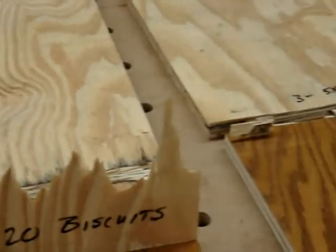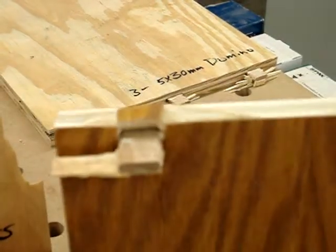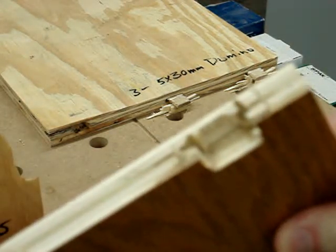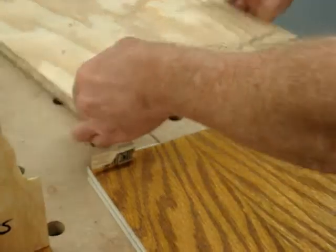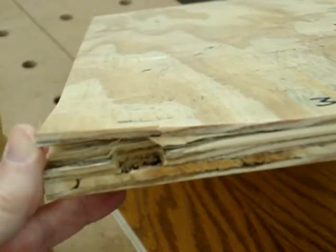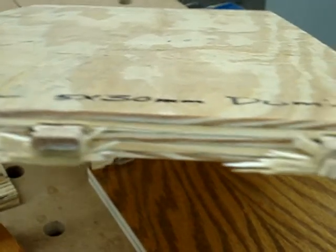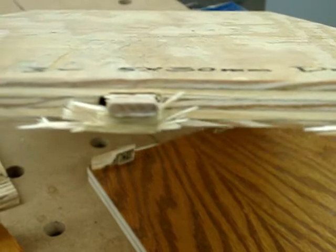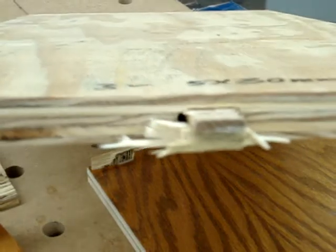And then finally, the domino joints. This is the side panel — the bottom of the side panel broke out on the dominoes. In the bottom shelf, there was some breaking on one end of the lamination. The other two dominoes at the medium width settings seemed to have no delamination on the bottom shelf. There are still remnants of the side shelf attached to the domino.